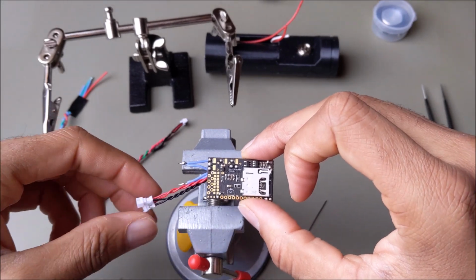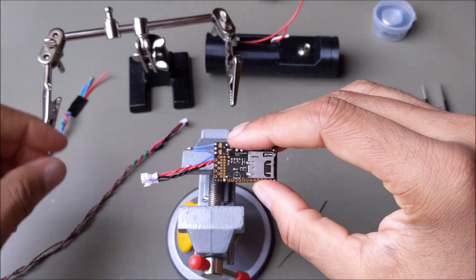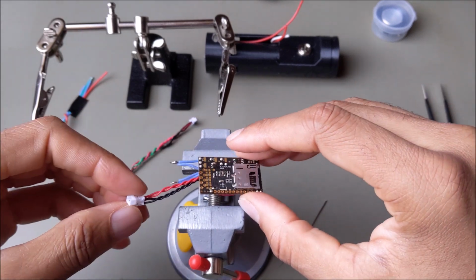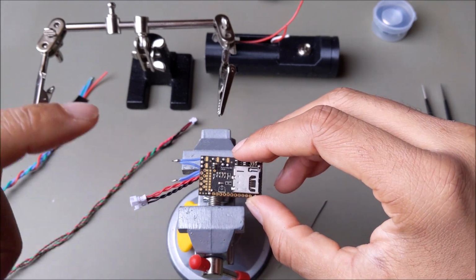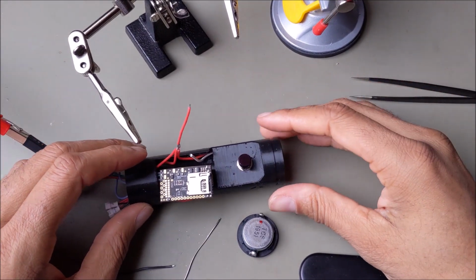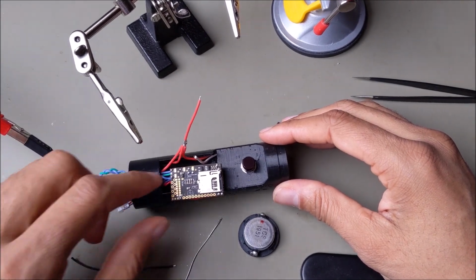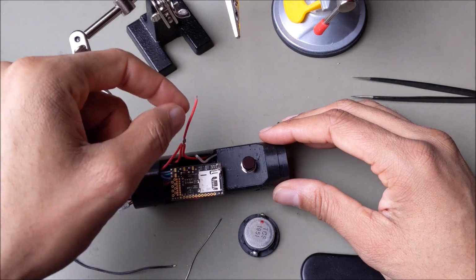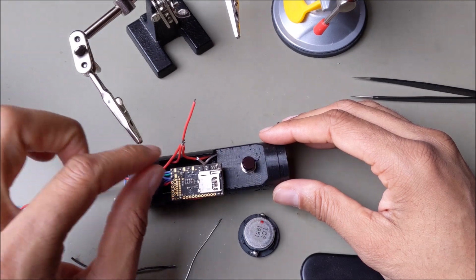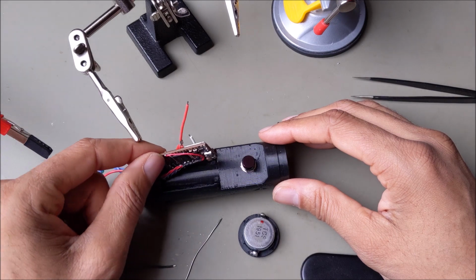Okay, the quick connects for the switches are done. I have that connected to the board and also to the switch itself. So that'll be nice and easy. Next thing, I'm going to connect the neopixel. I'm doing a real kind of ugly dry connection here. I've got the neopixel connector attached, and I've got the power wires just spliced into one for now just to connect for the test, and then once I know everything works okay, I'll clean this up, do the right lengths, and make sure everything's neat and organized in there.